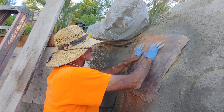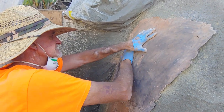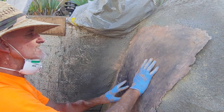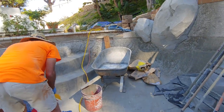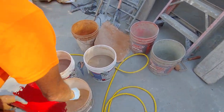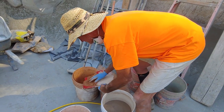When you spray it out with the hopper, the coat is — if you'll pardon the term — really snotty, really watery, and it's hard to get it thick. This section has got a nice leaning-back pitch and the basic cement underneath is really pulling moisture. I'm twisting the stamp, which changes the pattern. You can load it up a little bit more — you can see some nice patterns there. I'm going to bring in one of those little stamps to fill some of the gaps. That looks really good! I'll take this little guy with the bright red release and put a light coat — this is a new one, some kind of brown.